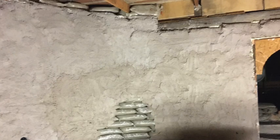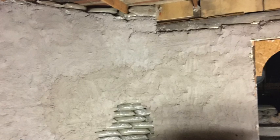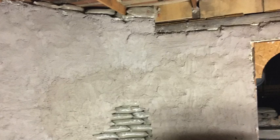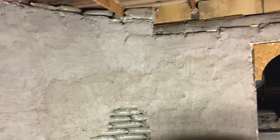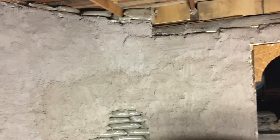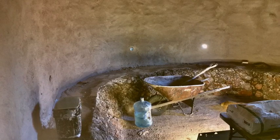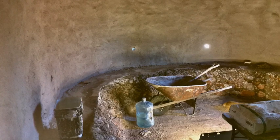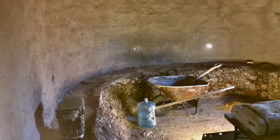At this point you simply keep dampening the surface. You'll see little shrinkage cracks form — I'd dampen it with water and run over it with my hands to smooth it out as best I could, then just let it do its thing. I'm going to leave off on this video and in part two I'll talk about the final coat, which uses different ratios, as well as the lime wash. Hope you guys like this video — please like and subscribe, and I'll be back with lime plaster part two.